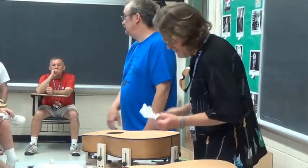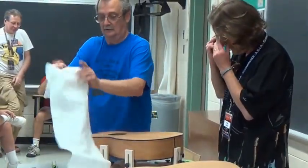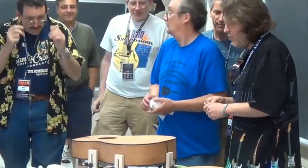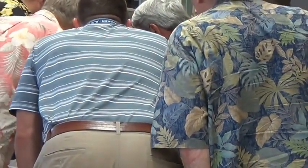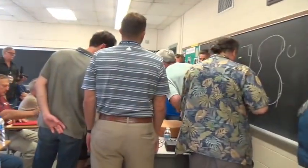You want to come up and take a look at this? That's perfect. Okay, was that hard? No, the way I was doing it was hard. That's easy. The more you can break those lines up, the less it will be seen. And guys who want to finish like you back there, you want to try to keep the gaps as tight as possible. I mean, you're dealing with a natural product, so there's going to be some porous areas. The more you break it with the knife as you're going along, the tighter the gap.